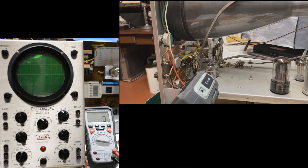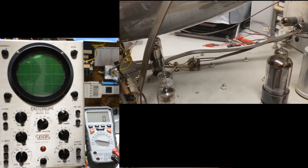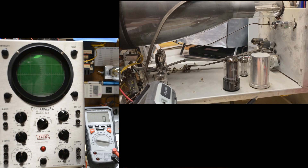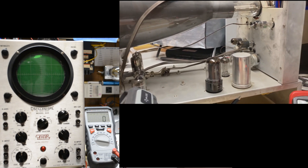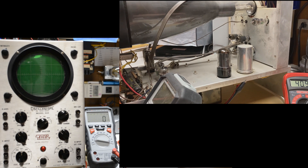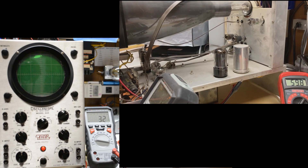Let's take her up to 60 volts AC. We've got five, seven, eight volts of DC — it looks like that rectifier is beginning to conduct now, and Ico is fighting back a little bit. We're seeing a little bit of filament indication — yes we are — and plenty of dial light. That shows us that Ico's got a little bit of juice left in his transformer and nothing has shorted out yet.